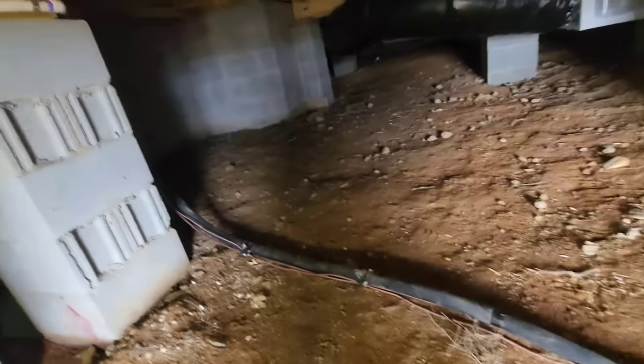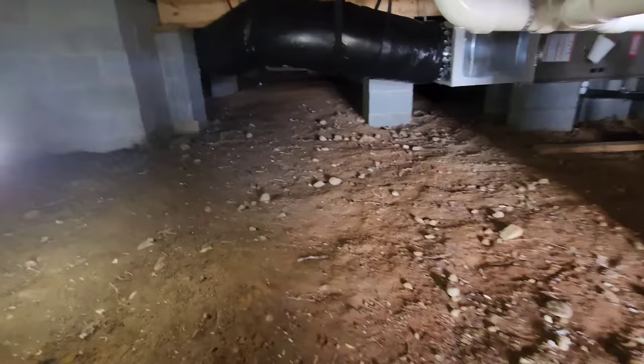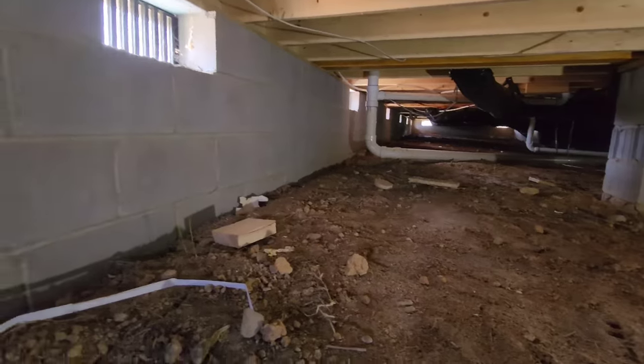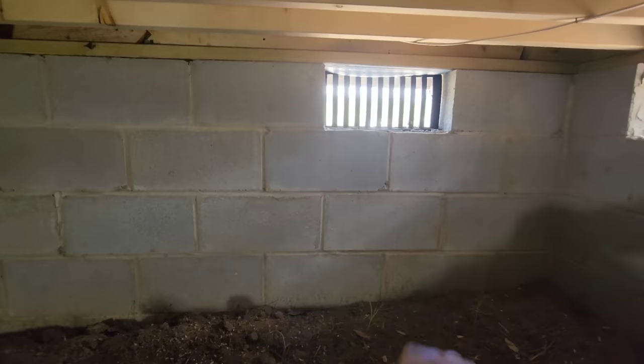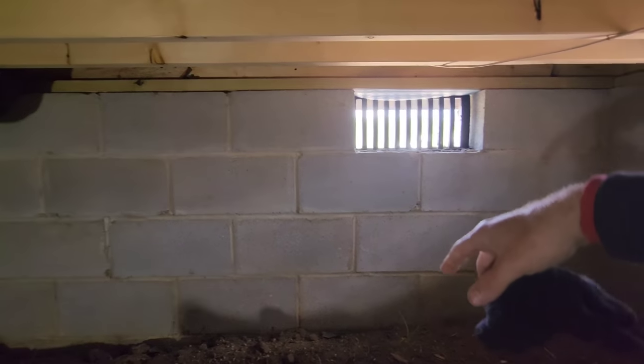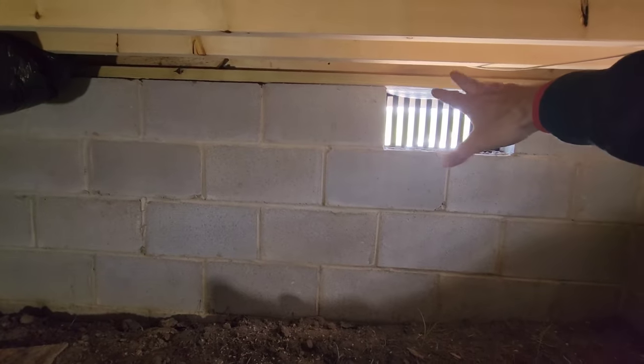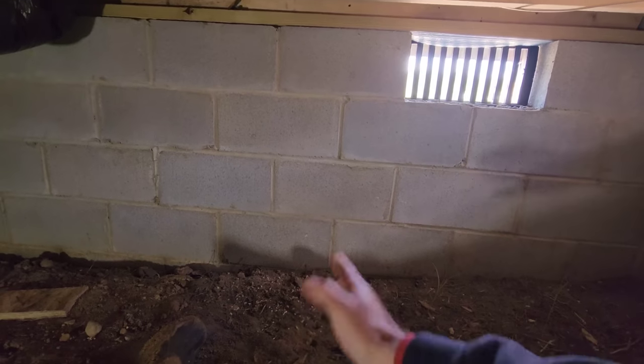Now we are under here, let's begin the journey. We've got drain on there, so we're good. All the other utilities come in on this wall and we're gonna come in on this wall. I'm gonna use this vent here as our reference point and come in one block over that way. Because of the cold air from the vent, you've got to worry about the pipe freezing, so we'll bring it over a little bit and come through right here — that's where we'll dig.